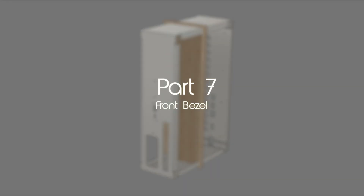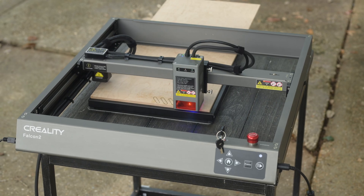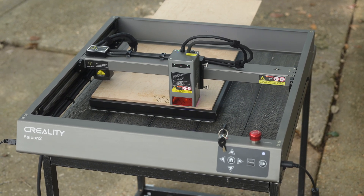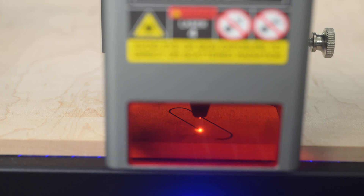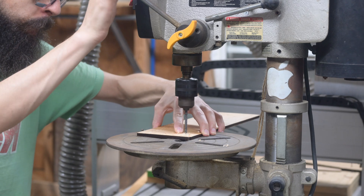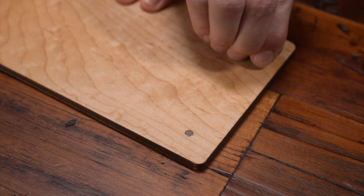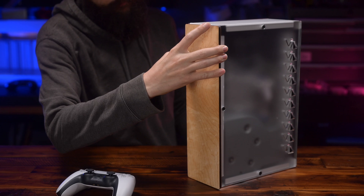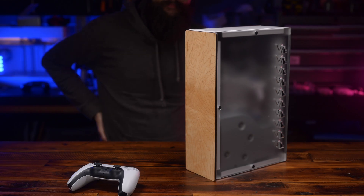The last piece is the wooden front bezel — about as simple and lazy as I could possibly get. I cut a beautiful piece of curly maple on the Creality Falcon 2, definitely one of my favorite tools at this point. It requires a lot more power than walnut or cherry, but I put the settings in the description so you can get perfect cuts the first time. I then bored four holes for magnets, being very careful not to drill through, and even more careful to glue and press them in. My friend doesn't use the disk drive or front ports on his PlayStation, but I want easy access in case things change. It also doesn't block the Wi-Fi or Bluetooth antenna because it's wood.